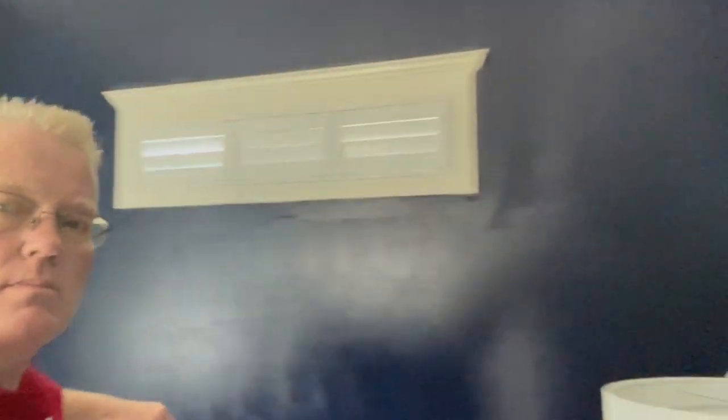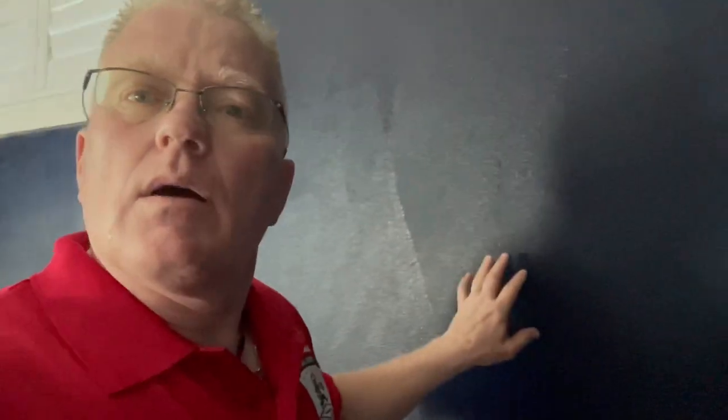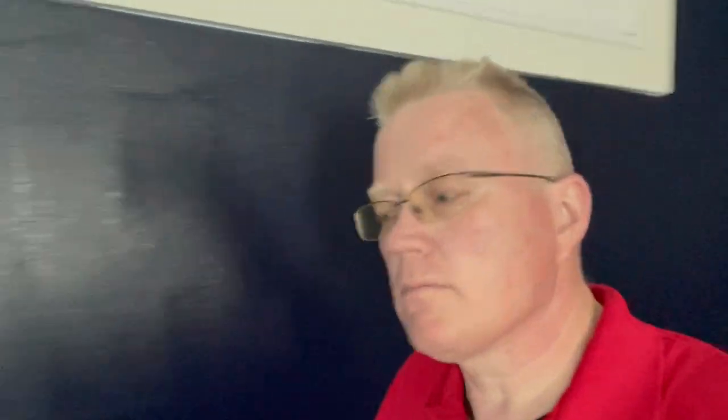I'm hanging a very nice Phillip Jeffries product today on this wall. The wall had a very high quality eggshell finish latex, that is water-based paint on it. And so we treat the walls with Roman 999. Okay?